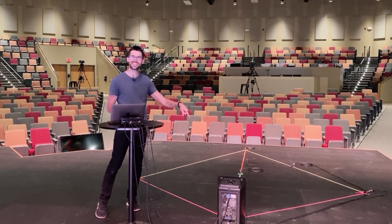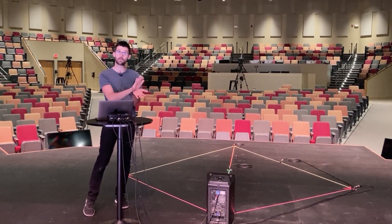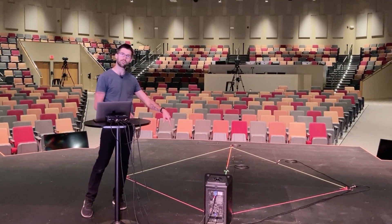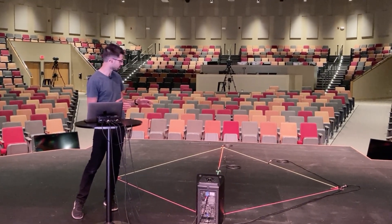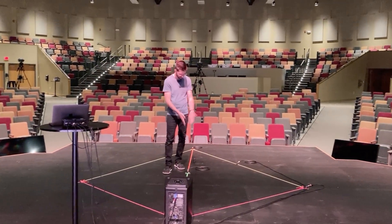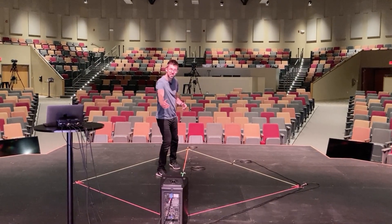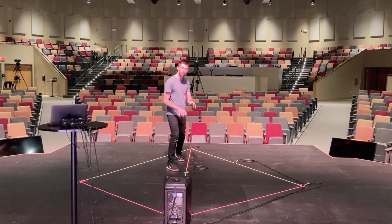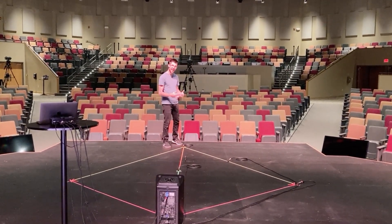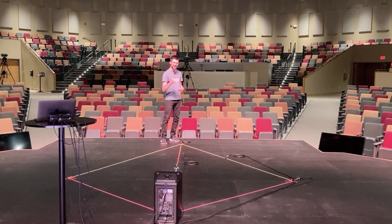I've got a QSC K8 right here. It is a 105-degree wide speaker, and that's also its vertical coverage. It is turned upside down because we're doing a ground plane measurement, and I have its tweeter closest to the ground. I've placed four microphones throughout here. My first one is my green microphone, my A microphone — this is on-axis, directly in the center of the speaker's throw, and it is six feet out. My next microphone, on-axis near. My next microphone is on-axis far — I've doubled that distance and this is my orange microphone. So this is six feet on-axis, and 12 feet on-axis far.